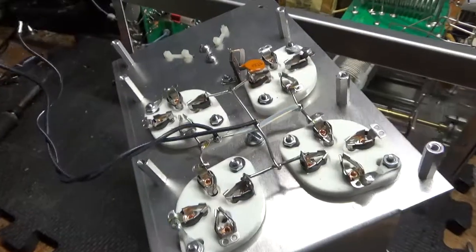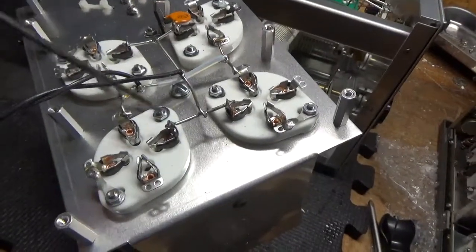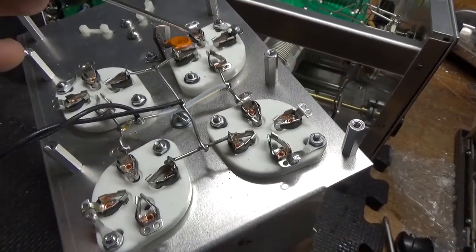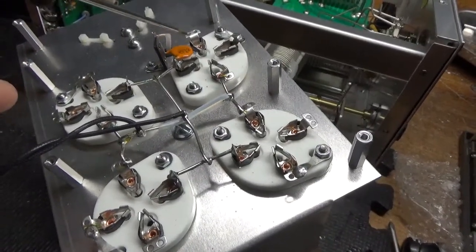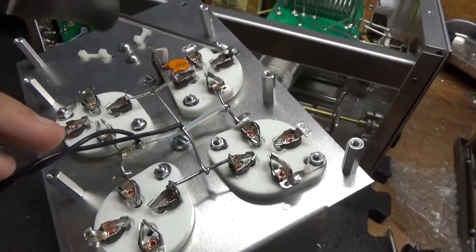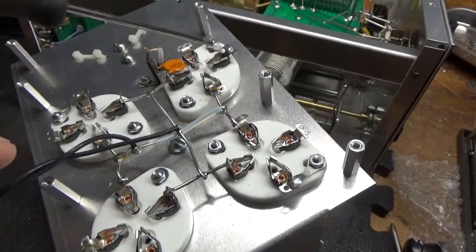I'm going to show the bottom of the sockets. This has four sockets, as you can see. All filaments are wired in parallel. You always want to check the solder connections for the filament. Two of the connections are for the filament per socket. One does nothing. One is for the grid — that one has nothing connected to it. The pin coming out of the tube for that connection does nothing electrically within the tube; it's not connected to anything. So that's why it's so critical to maintain a good connection between that one grid pin and ground. If you lose that connection, there's a good chance you'll end up taking the tube out.